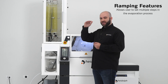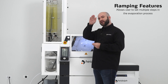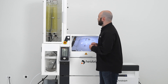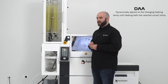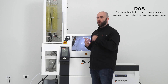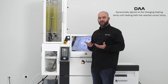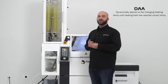Ramping allows us to set multiple steps to an evaporation process. This is incredibly helpful if we're doing multi-solvent evaporation, or even powder drying where we want to set a nice even ramp at the end to truly dry out that powder. You can set a large number of steps, all with different varying time parameters. We also have an automated evaporation feature called Dynamic Auto Accurate. That uses the temperature sensor placed inside your condenser coils, which waits there until a heat load is shown. While it's waiting, the vacuum level drops slowly until vapor is produced, which carries the heat load over the sensor confirming evaporation is occurring. It then holds the vacuum and continues the evaporation process until there's nothing left evaporating, at which point it will either shut down or keep searching for the next boiling point.